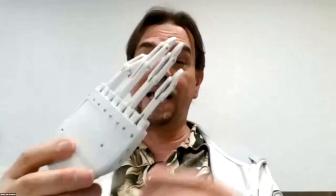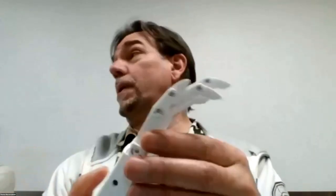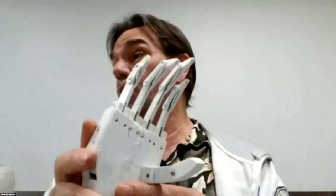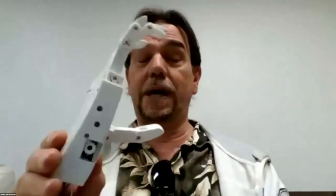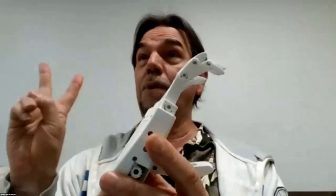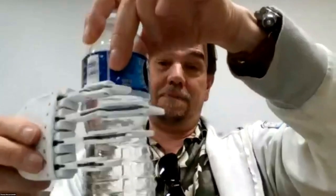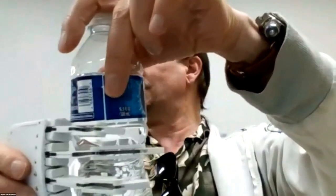There we go. So this is the hand that I worked on with a gentleman, Eric Ohm, and he was just finishing up college and needed a project and a company to work for so he can go into a real company. So we worked together on this. He did 99% of the engineering. I did a lot of feedback on it. And the idea was to use at most two servo motors, one for the thumb and one for the fingers to close the hand, because I wanted it to be able to grip a bottle or a cup. And that's it, because most of the hands out there are not designed to grip anything. This is probably too heavy for this thing, because the servo motors are not really too beefy. But you can see, if you turn that clockwise.